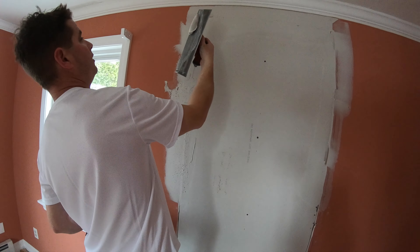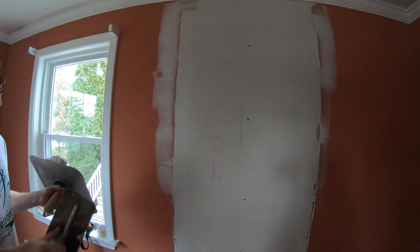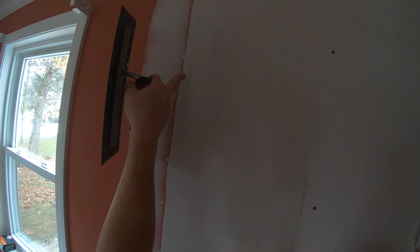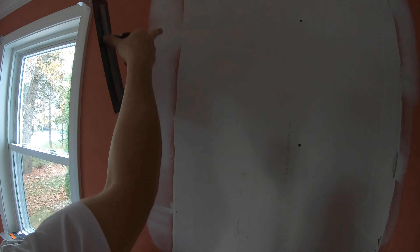I'm going to load up a little bit on the tip there, come up here, and swipe down. You can see right here where there's an impression — this is one of those areas where there's like a quarter inch gap. I need to put more mud there. I could leave it and fill it on a second coat, but why not just fill it now? Come up here and swipe down hard — that filled in that area. I effectively brought the mud out there to the right.